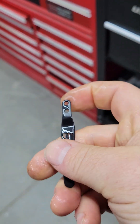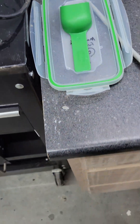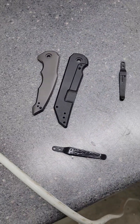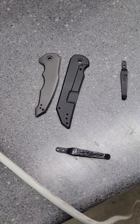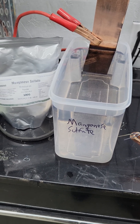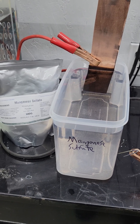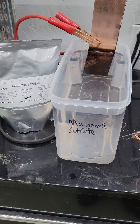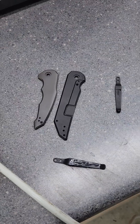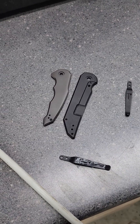Pretty slick process. It's pretty durable — it's about as durable as your base finish. So if you do a stonewash part or a bead blast part, it's going to be pretty durable. Sandblast still scratches just like sandblast does, so you get snail trails and stuff like that. Mike over at Key Bar gave me the rundown on the chemical — I've been trying to find this for years, so I wanted to share the love and put this out there to anybody that's been struggling to make titanium black.